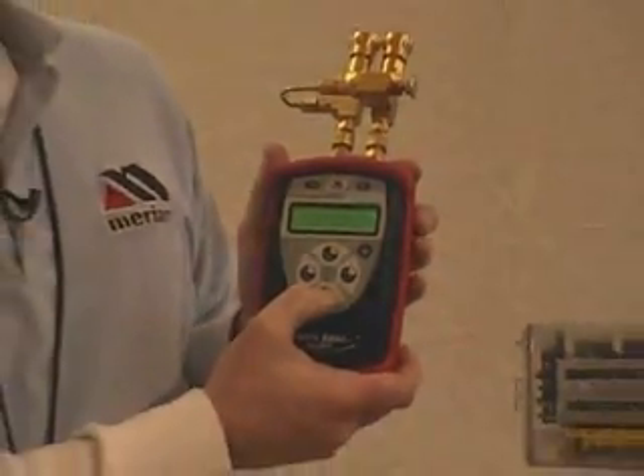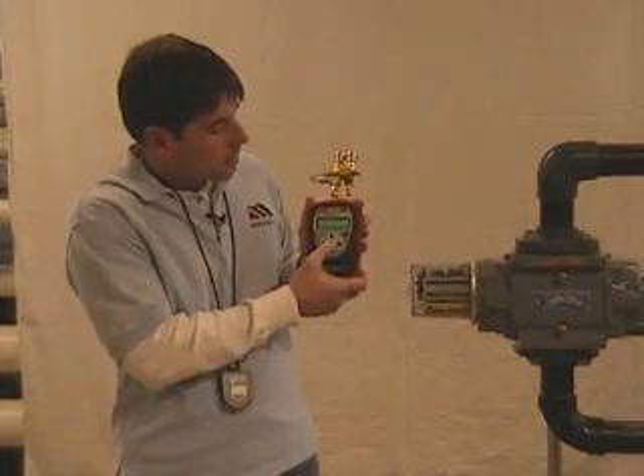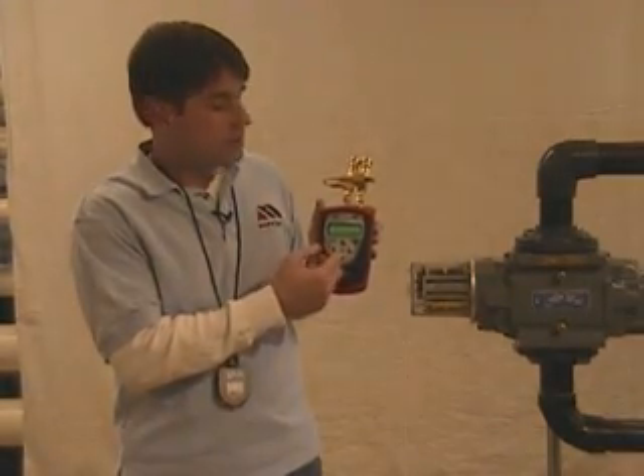To verify you have zero, hit the acquire data button and press it again. You should have a good zero on your meter. Now, it may flicker from one or two counts. This is a 28-inch model, which has three decimal places.